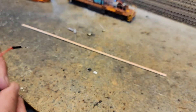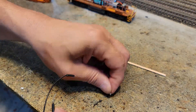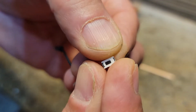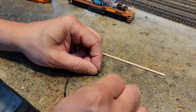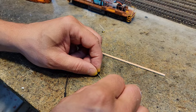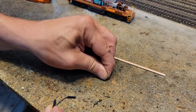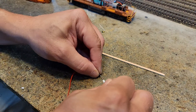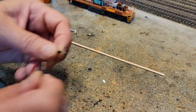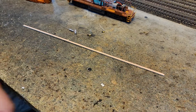Right now I've got the benchtop power supply set at two volts. I'm just going to line it up. If you can see, there are two little strips on each end — one is plus, one is minus. So with two volts, I'm going to touch a red and a black lead to the sides to see if I can get it to light up. There we go — lit up, very good. Now I'll flip it over and check what happens if we turn it around. It is not lighting. Okay, so that means that side is the minus.